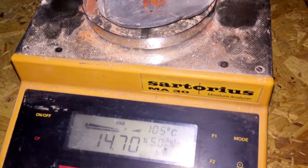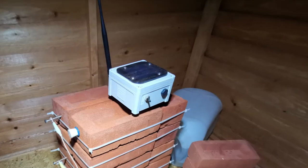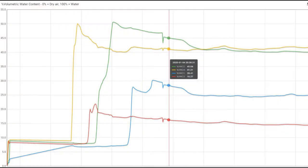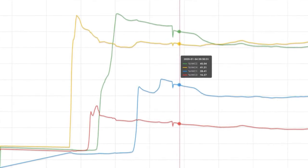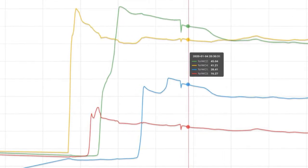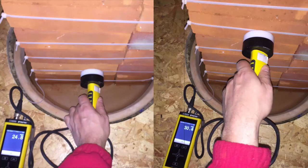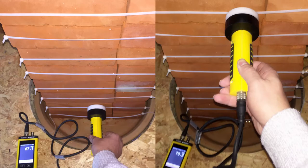The embedded electronic sensors, placed vertically, clearly registered the rise of water, one sensor after the other. Microwave meter measurements also captured the wetting of the walls all the way up — initially low readings throughout, then later high readings throughout to the full height of the test walls.